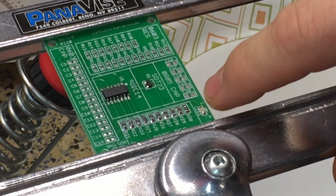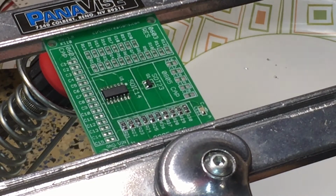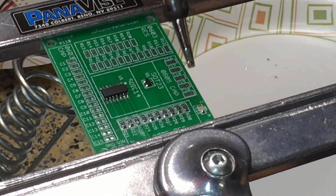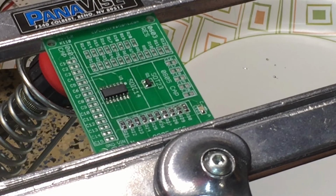So your green dash goes here. I used a nice decent gob of solder paste on those pads, and then I made sure that I attacked them straight with the chisel tip very quickly to try to not melt the LED, since the housing is probably plastic. I would imagine it's resistant to some degree. You wouldn't be able to use a reflow oven on it if it couldn't resist some heat.